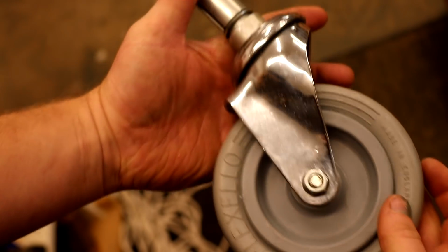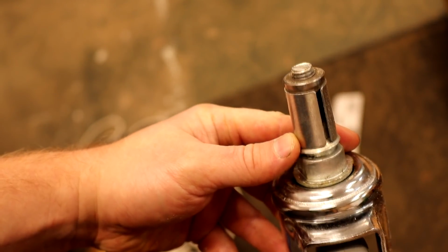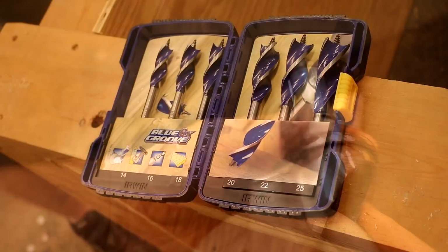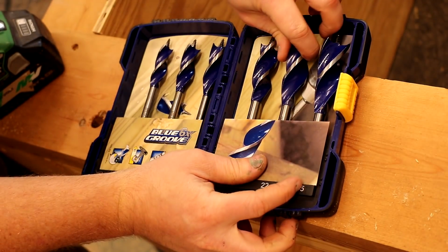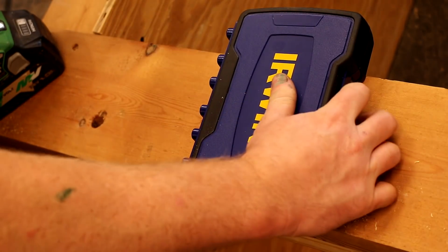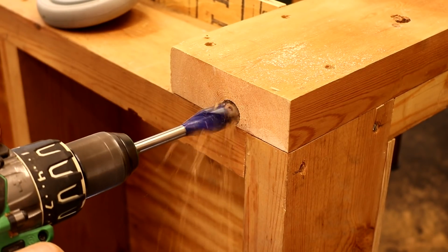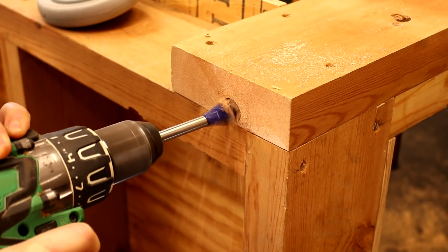I can always buy some locking castors to replace them later down the line if it turns out to be an issue. These had split compression fittings at the top, and the shaft of them measured about 22mm, but I didn't have a drill bit that size, so I bought a set of these Irwin Blue Groover auger bits, which had a 22mm bit included, and that worked great, and I'll link to this set in the description box below if you're interested.